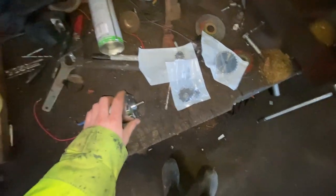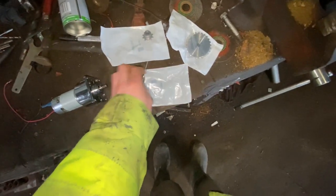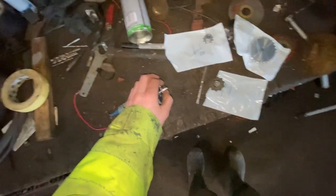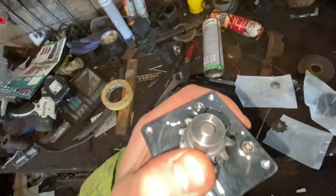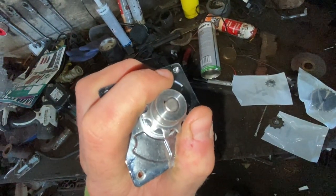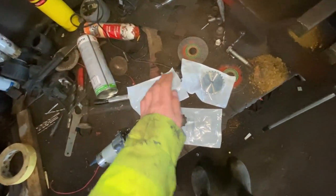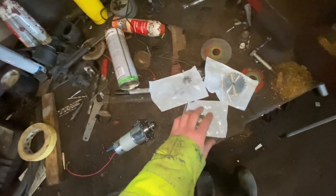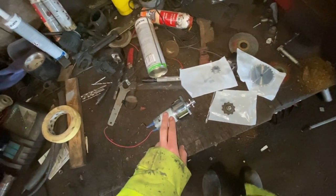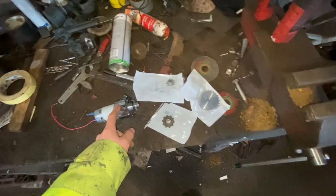One last thing I'm working on: this is a motor I got for my egg belt and I've just cut in some sprockets. I've got to play about with these sprockets and get a gearing system that works. This guy goes on the shaft — I actually need to drill and tap this so I can get it to fit on the key. The shaft has a key on it; I couldn't get a sprocket this size with the key in it, so I need to put a little screw down into this to hold it in place. Then I need to mount another one on the egg belt. I've got a couple of different gear sizes so I can get a different ratio if I want to go faster or slower. I think this motor should power it — there's only one way to find out.